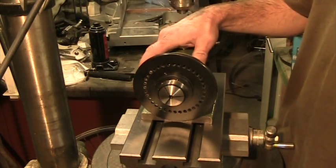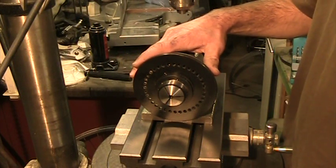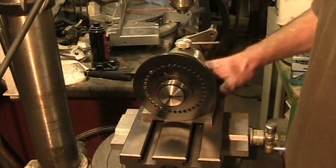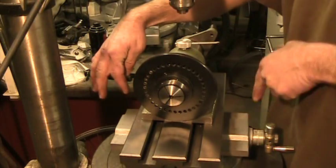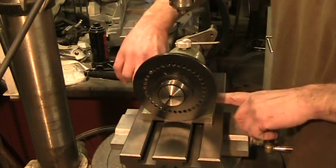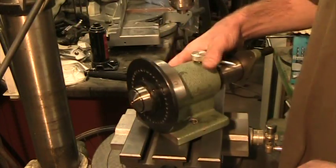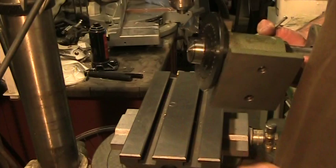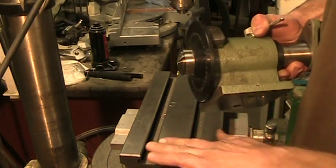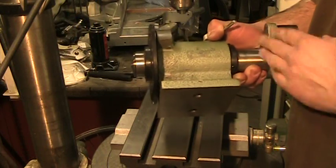And I was thinking I have 2 modifications to this that makes it a little more useful for some people — like mounting it on this small cross slide table. You don't have alternate slots because the table is not very wide to clamp it with strap clamps. So about 2 years ago I drilled it to match the T-slots, which makes it a lot easier to mount because the straps don't get in the way of the handle.